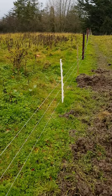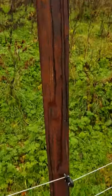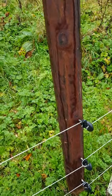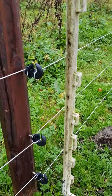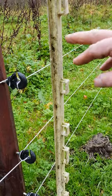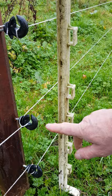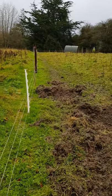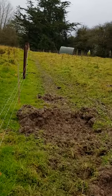But they are useful for supporting the wire between your straining posts. I put one of these every three paces. Now the tip I found was what height do you put your insulators and your fence lines at. What I normally do is push this down in beside the post, and whatever height you want your electric fence at, just put an insulator in opposite it — and regardless of what way the ground is undulating, the lines will stay all at the same height.